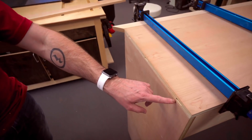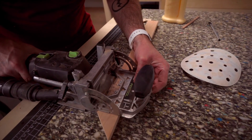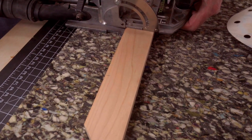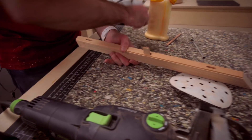So that creates a little hole there, and then on the mating piece you just line up that line with the tick mark. Then you buy these little dominoes to fit in there.